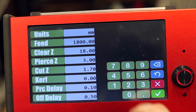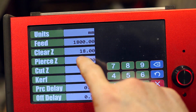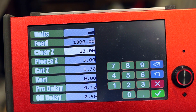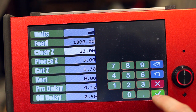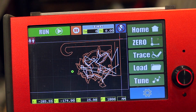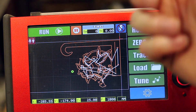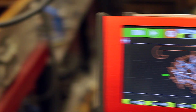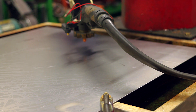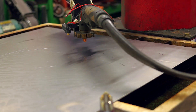Just a couple of notes. I'm going to use my settings — we're going to run 1,800 millimeters a minute. Clearance I'm probably going to put down to 12, because there's not a lot of big drops, so that should be okay. You can see everything else is exactly the same as my test cut. The way I've set this up, I've got a left version and a right version which is flipped 180 degrees, because on my sheet of material I can get two of these in that space. With this 24 by 48 sheet of 14 gauge, I can cut two there, then slice a straight cut across to re-square an edge and continue on down to get a bunch out of a single sheet. That's how I maximize my use of material.